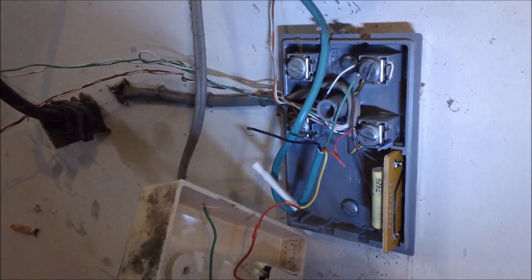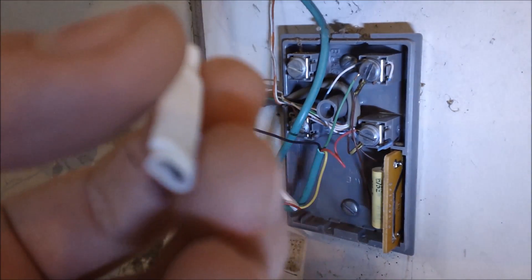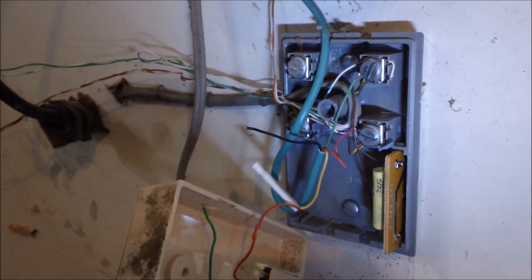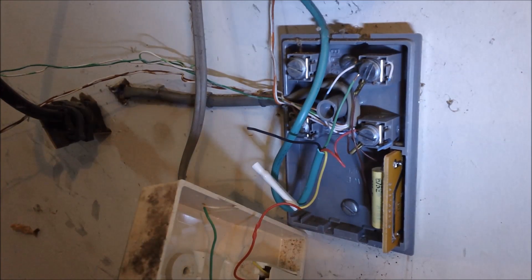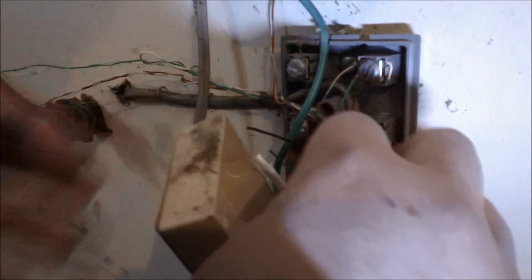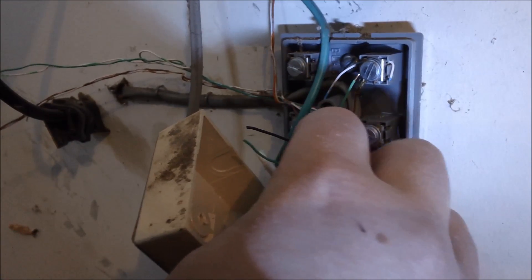The second problem here is this is a god-awful splice. These little plastic heat-shrink splices — you don't want to use those. So I'm going to take my pliers and pull this splice right off, because it's really just an awful splice that should never have been used in the first place. This plastic heat-shrink splice comes undone if you even touch it a little bit. So discard that — you're never going to want to look at it again. That was the problem in my case, though it might not be yours — this is just a general tutorial on how to fix phone line issues.